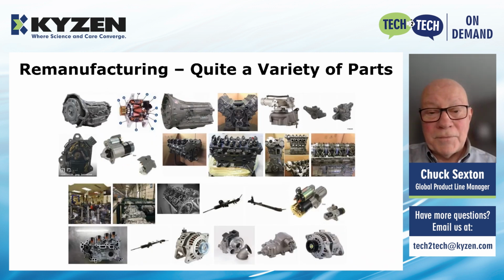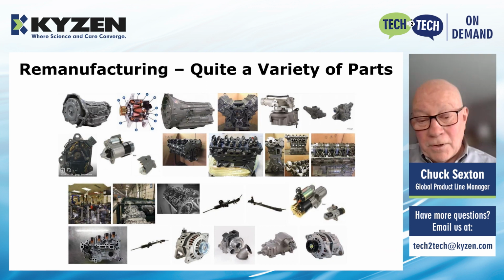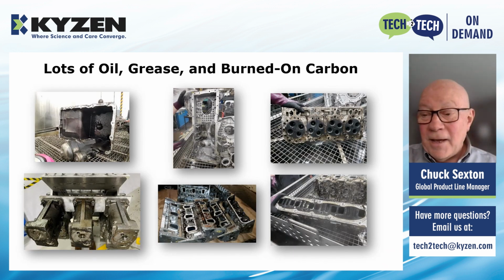So we see all these different parts in engine and transmission remanufacturing, not just the transmission and engine components, but alternators, fuel rails, fuel pumps. A lot of different parts come into this operation, and most of them have pretty much the same contaminants on them: oil, grease, and burned on carbon. In the cleaning world, these are, especially the burned on carbon, three of the most difficult contaminants to remove, and they're heavy. You can see that picture in the top right. Getting that burned on carbon off is a challenge.